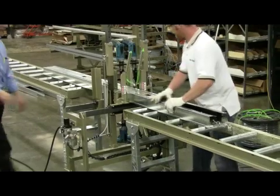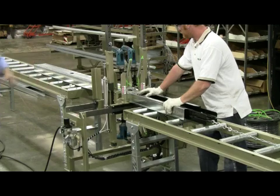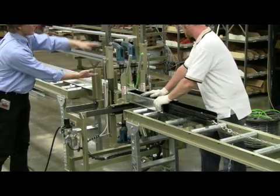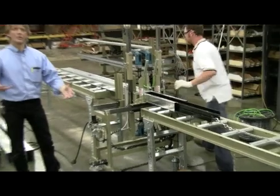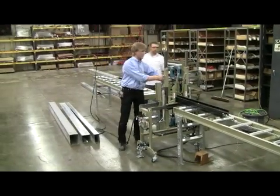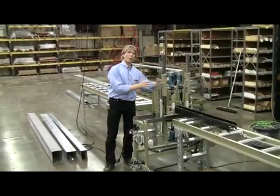Works pretty slick. We've actually got castings incorporated on both sides, slide systems going up and down. Main cylinders are actually stroking these as you see them coming down. We can mount anybody's screw guns on here. You just have to tell us that in advance. Some screw guns, depending on the size of the body and so forth, are going to limit how far we can go down.